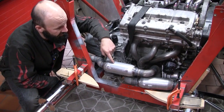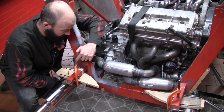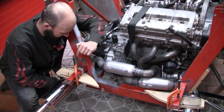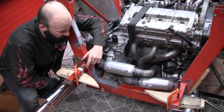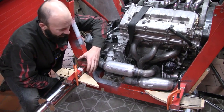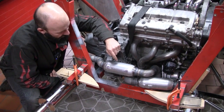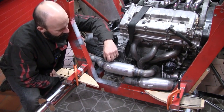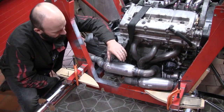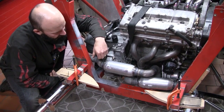Time to mount the exhaust. So the plan, well, basically just going to upgrade this cable tie MDF and G-clamp arrangement with something a little bit more suitable and rubber mount it to these little RHS standoffs. But I also want to add an intermediate hanger to support the whole system sort of around the location of these two mini mufflers.